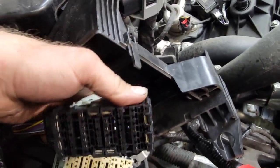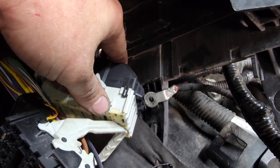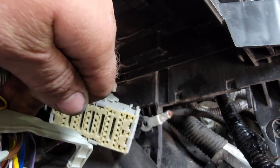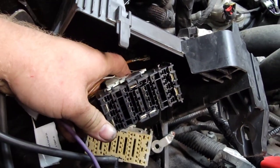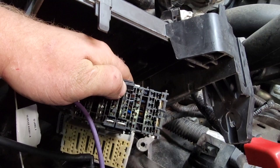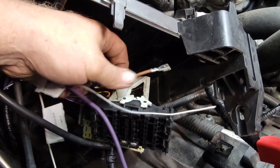Just peel it back, get it out of your way. They want you to pull the bridge off the white connector. There are four relief tabs — take a flat blade screwdriver, a little pocket screwdriver, and pull up on them. They slide right out of there. If you're looking at it with the dovetail down, you're pulling this brown wire — it's the only solid colored brown wire in this entire box. There's a little release tab right there — pull the release tab back, slide this out. 100 millimeters is about 4 inches, so cut it right there. Save your end — you need it.